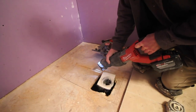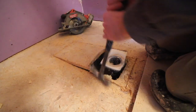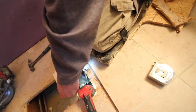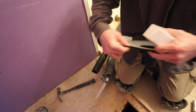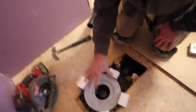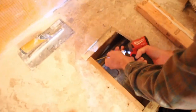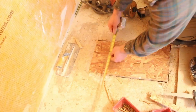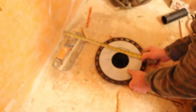Before adding the waterproofing, we cut out a section of the subfloor to reveal the drain, because this drain was offset and needed to be relocated. We cut the drain using a sawzall. This is the Schluter ABS drain we used — they come with spacers you can put in the drain, but don't throw those away. We added wood blocking using 3-inch deck screws, marked the center location for the drain, and cut a 5-inch hole, which is the max hole for a Schluter drain.